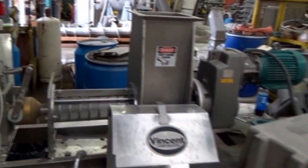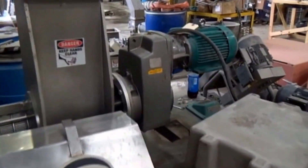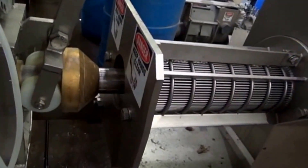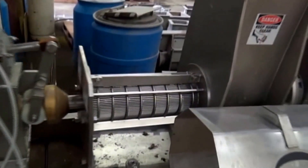We're going to run it in this little screw press here. You see a motor and a gearbox — that drives the screw press to force material through. The solids will come out of this end and the liquid will come through the screen. See if it works.